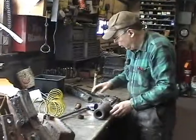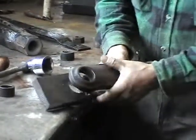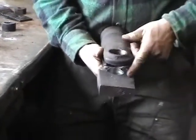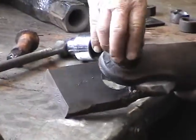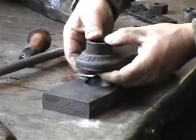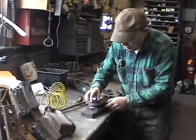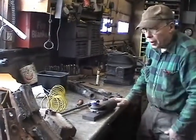The brakes are adjusted with turnbuckles. This is the end of a turnbuckle — this one had also broken right off. The two sides are supposed to be the same, so our machinist welded on a new piece of steel. He will then cut it so that it looks the same as the other side, smooth it off with the milling machine, and put hardened bushings in here also. The bushings are supposed to press in — otherwise they'll fall out. They're made just a little bit oversize and with a hydraulic press they push them in.